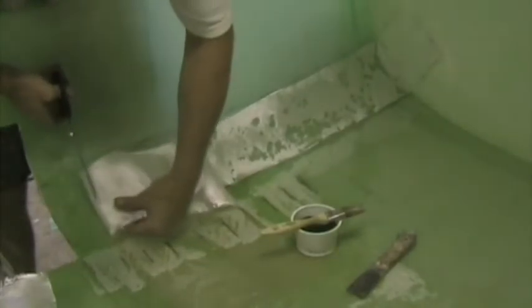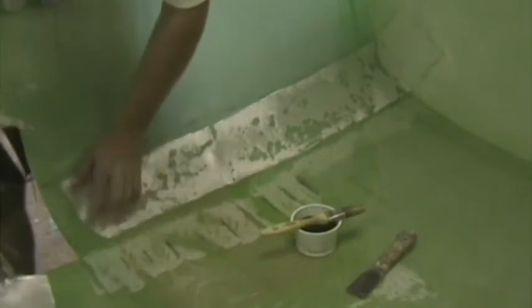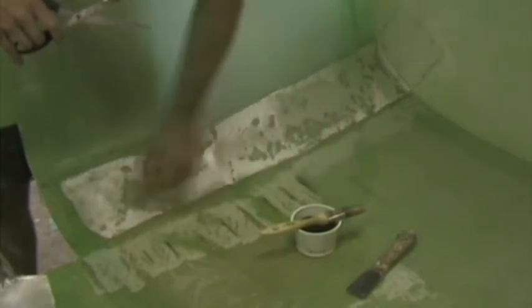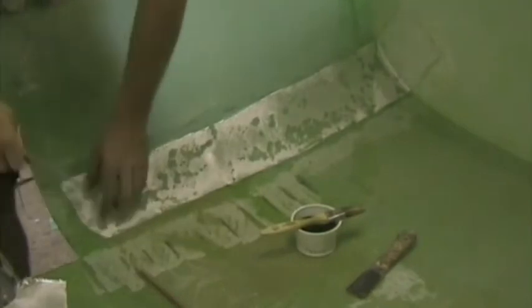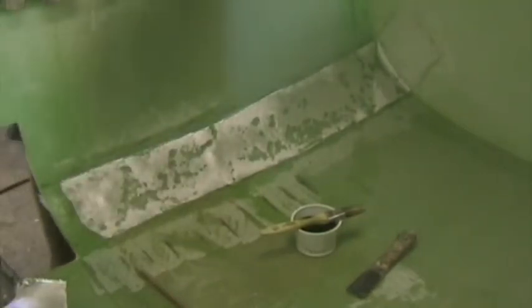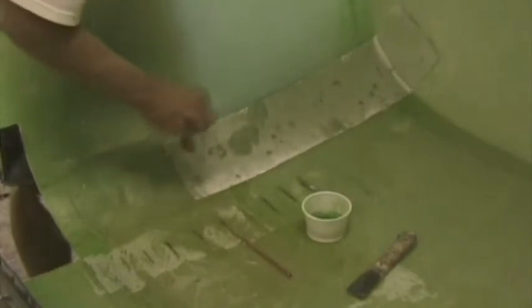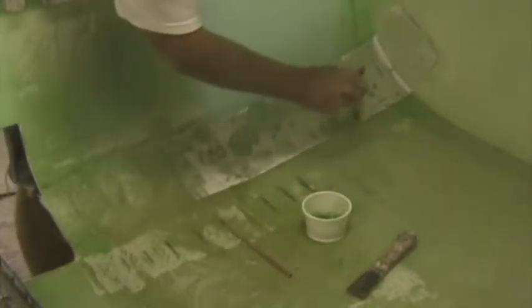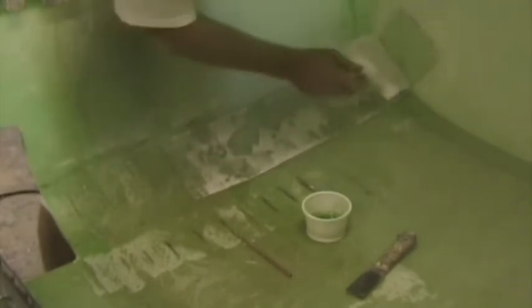This is the second layer. I've made marks here to show where the layers end. First layer, second, third, fourth, fifth, etc., up to the tenth layer over there. I'll place the pencil there to remind me where I am with each layer. This is the sixth layer I've got going on. Just about to wet it out. The others are all wet out. Don't try and wet out a layer unless all the layers below are completely wet out. In other words, wet out layer by layer.